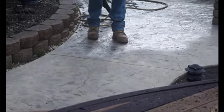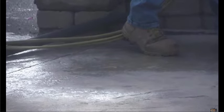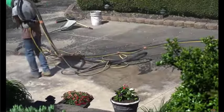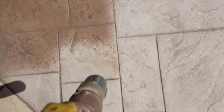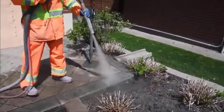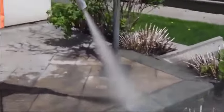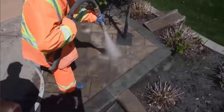The next method is using some type of sandblast, sodablast, or wet media blast — three different options. This is going to completely remove any type of sealer, whether water-based or solvent-based acrylic sealer, and take it right back down to bare concrete. The wet blasting method is a little less dusty but still somewhat messy. It works really well and will get probably 99% of the sealer off. Note that this will also remove any color from the surface along with the sealer, so you may have to recolor it afterward.